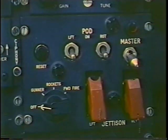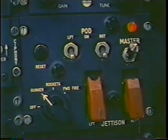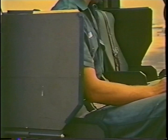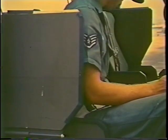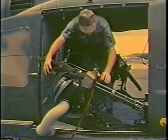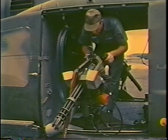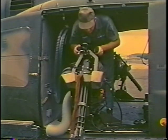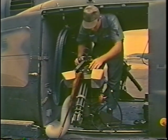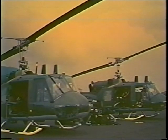An armament panel to fire the guns and rockets is located in the cockpit on the console between the pilot and co-pilot. The gunship also has armored seats and self-sealing fuel tanks. With guns and rocket systems installed, fully loaded and fueled, with aircrew, gunners and their equipment, the UH-1F weighs 9,000 pounds. With this load, you are operating at maximum gross weight. With a full fuel load of 245 gallons and one pilot, however, the weight is only 6,500 pounds.